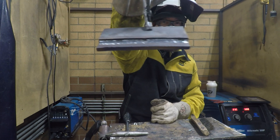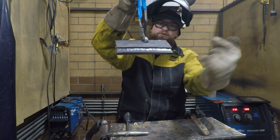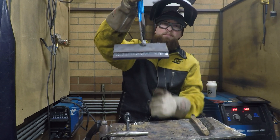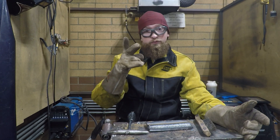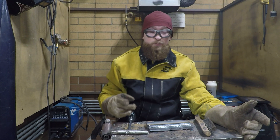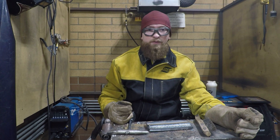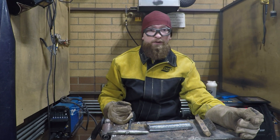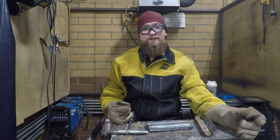There's your lap joint for a single pass — consistent bead width is what you're after. Chances are you'll do a first one and if it's not consistent enough, you'll do a couple more to make a nice consistent finish. Again, two two-inch by six-inch pieces of five-sixteenths material, settings at quarter-inch for a single pass leaving the edge exposed, or go multi-pass to fill it up — in which case use half-inch or three-eighths settings. Make sure you chip between each pass and quench it often. Good luck.